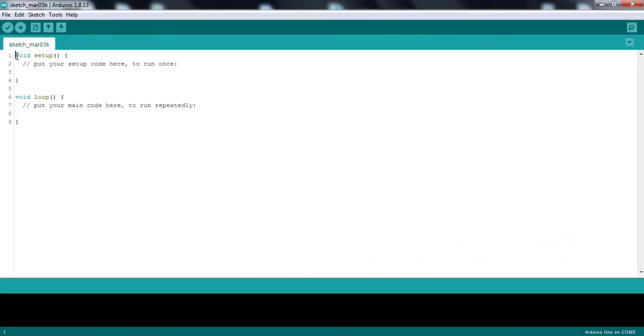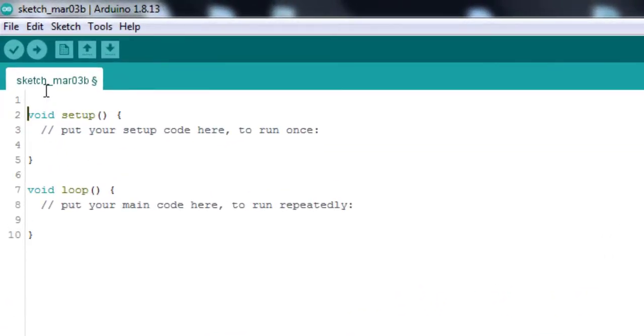To start, open the Arduino IDE and write the code that allows you to connect the Arduino board to the smartphone and receive a message containing the command to turn the LED on or off. Declare an incoming value variable of type char. This variable will receive the Bluetooth frame sent by the smartphone.